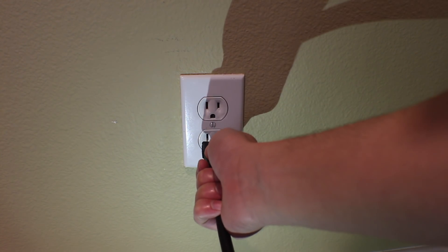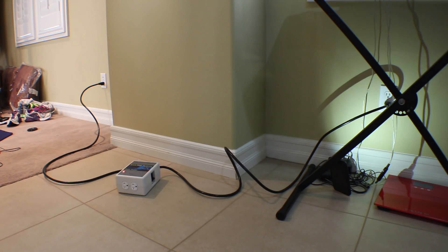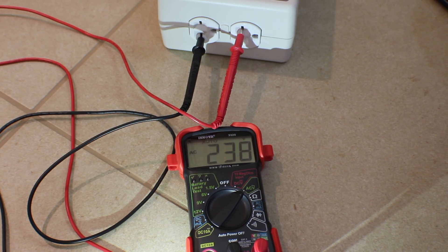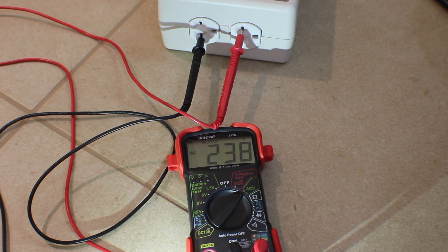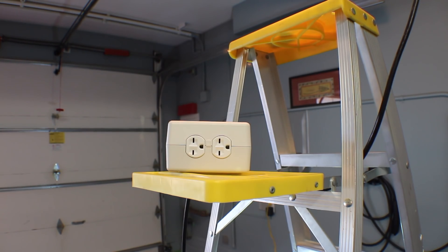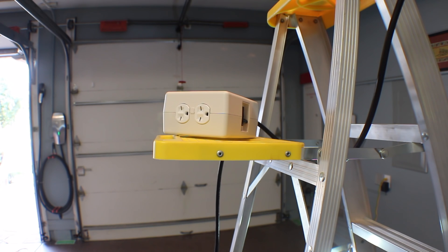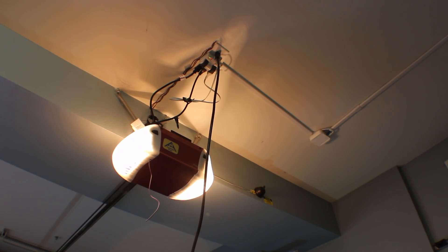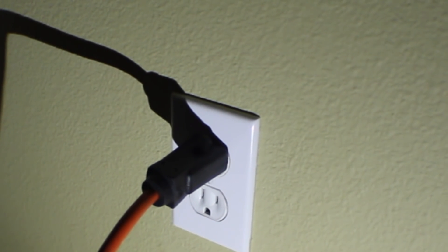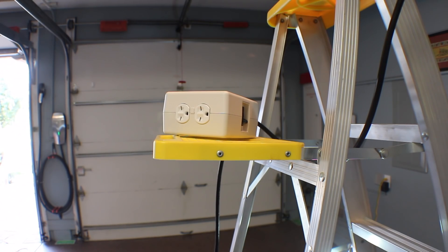Once you test both outlets, you simply connect the Qwik 220, and if everything is wired correctly, the light on the unit will shine indicating 240 volts. My voltmeter is also reporting that everything is working correctly. The unit also has its own circuit breaker so you can shut off power easily. Here is my Qwik 220 all wired up in the garage — I have it on the ladder for better lighting. Normally I use two extension cords to neatly run all of my wires, one hooked up to the opener and the other to an outlet behind my forced air unit. I would recommend a 12 gauge extension cord — I will have a link in the description.